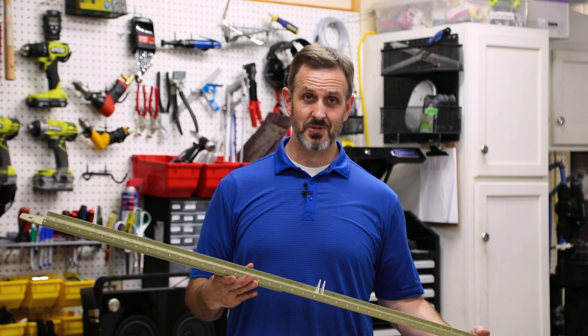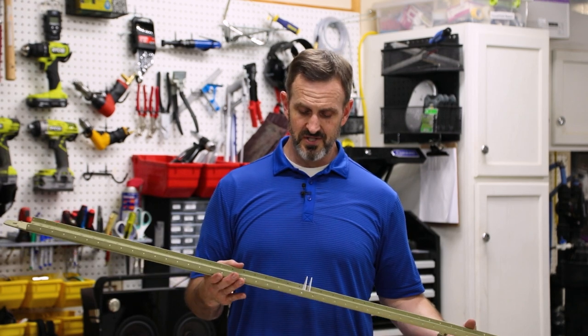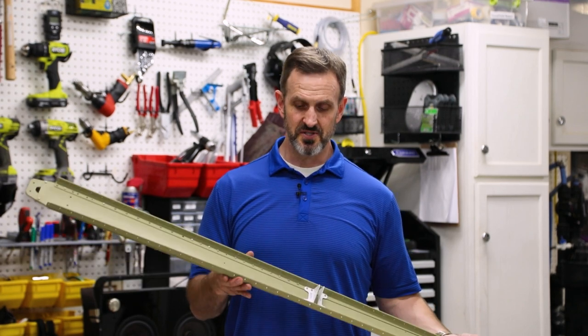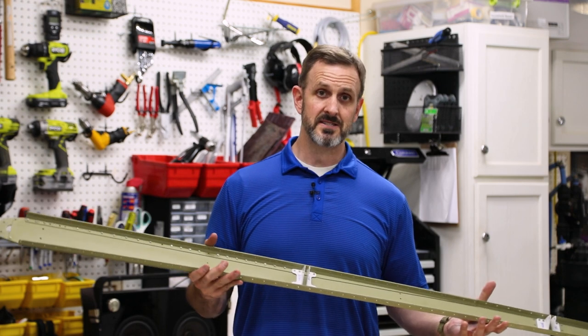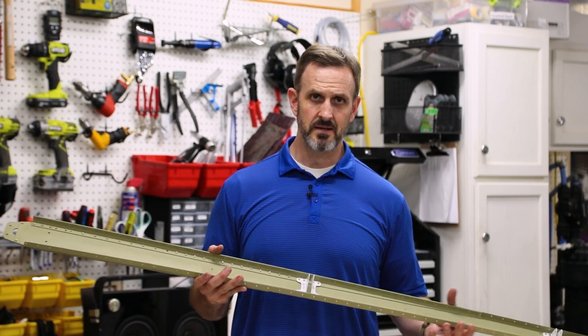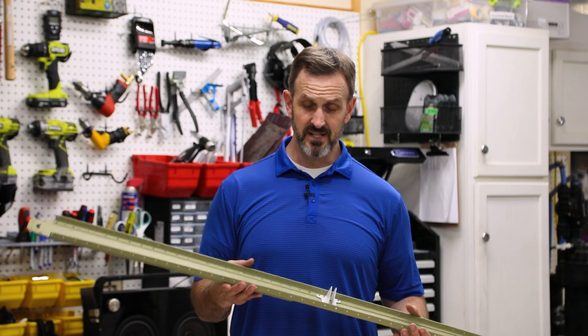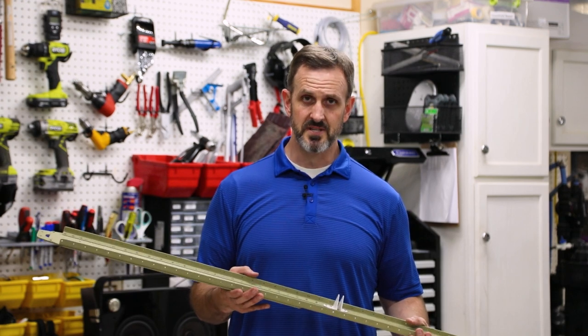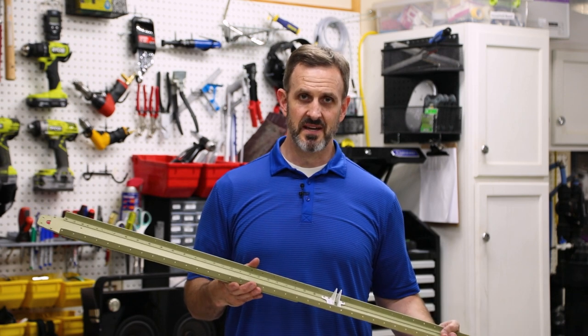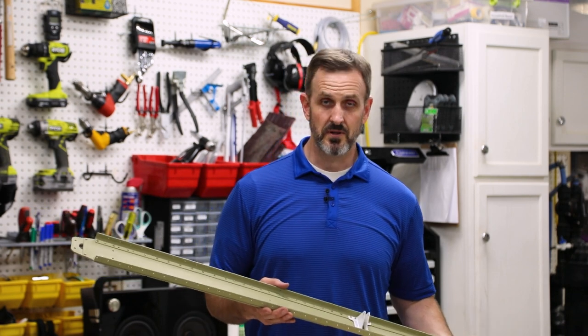The pneumatic squeezer is nice once it's dialed in. It's almost impossible to screw things up. It just gives very, very consistent results. The other nice thing about it is, especially on this part right here, you have different length rivets. But for the 1/8 rivets, I set it to 85 PSI on my regulator that I have the pneumatic squeezer plugged into, and it does it perfectly. For the 3/32 rivets, I put it to 55 PSI, perfectly. I don't have to adjust for the length of the rivet or anything like that. All I do is set the pressure regulator to that.